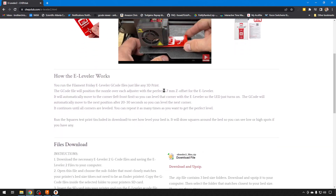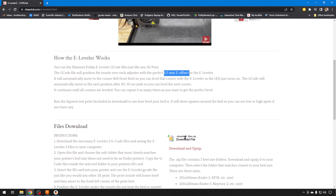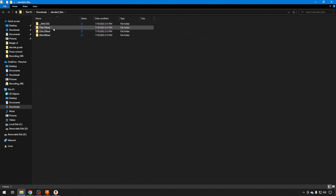There is some Z offset work involved, but the G-code files that are available handle all that for you. I'm still going to walk you through how this actually works. You download the zip file, and when you extract everything, you have some different bed size options — just pick the one that's closest for you. We've got the Ender 3 today, so we're going for the 220x220. These G-code files help the leveler get set up, running the commands and moving you to the spots on the bed that you need. There's also a test G-code that you can print with. We'll grab those two and put them on our SD card.